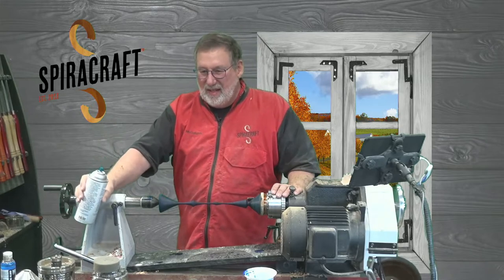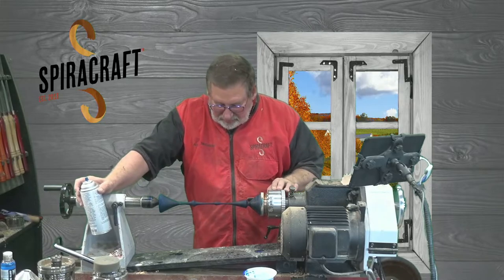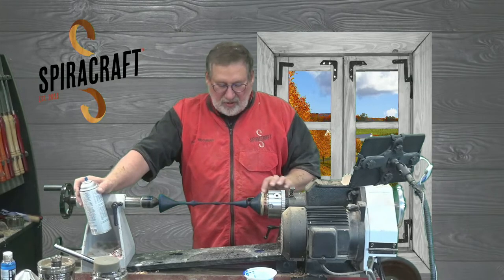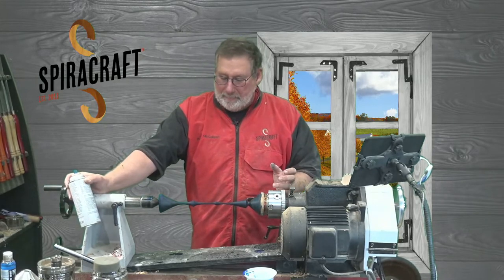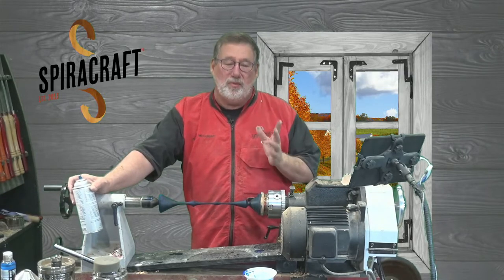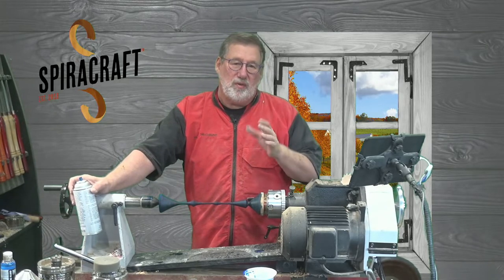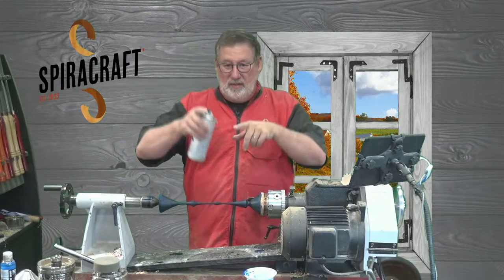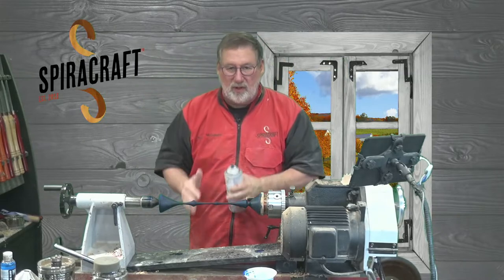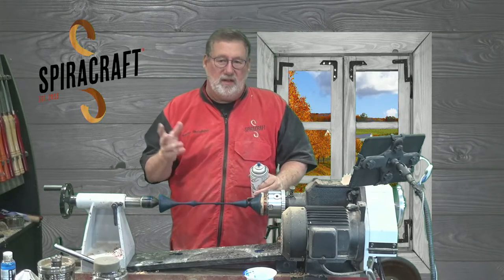Joe said, I saw Joe, red and violet. Those would be cool colors, Joe. Again, so it was a chunk of wood from, I don't know, I've had this maple forever. So what this is, when I cut my big bowl blanks, this probably came out of where, when I cut for the pith and I lay out, pith is in the center, and I lay out my big bowl blanks on either side, and then there's that section above and below the pith. Then I cut those off and I square them up, relatively speaking, and dry them up.